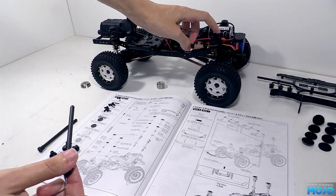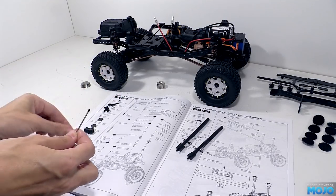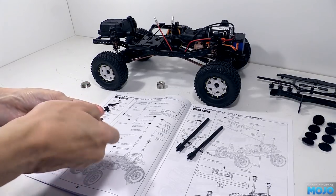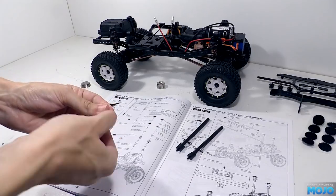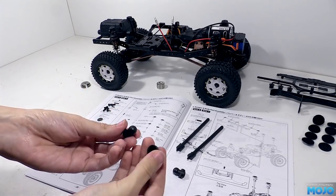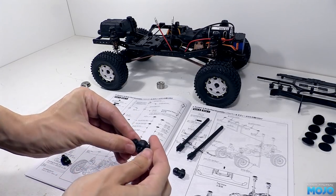work just fine. The ball part of the widget that fits on the top of the post needs one of the short grub screws installing just a few turns in one of the holes on the side. This will end up clamping it to the post, so they only need to be in far enough that they're not going to fall out. Now we can clip the ball into the socket so we can install one of the M3x8s.